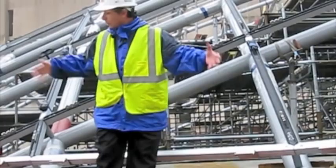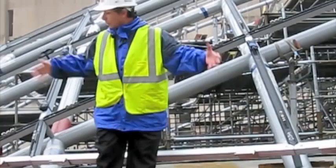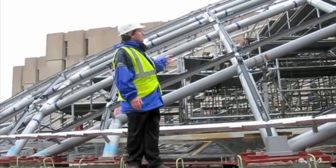It'll all self-support right on this actual rim all the way around. But we don't want to pull out the scaffold until the glass is installed so it's fully loaded. So this is the next phase: we install the glass, then we do the sealant.